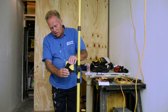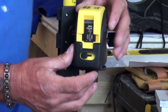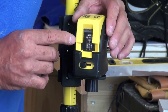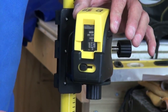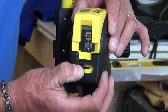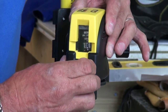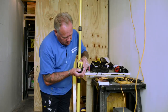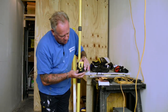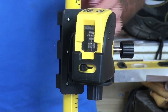At the front of the laser level — the cameraman may be able to see the laser actually moving around in that little glass window. To lock it, you simply slide the locking button along and then you can set your own lines and levels. Sometimes this is a bit tricky to get back. That's unlocked again and you can see it wiggling about — it's a self-leveling device.